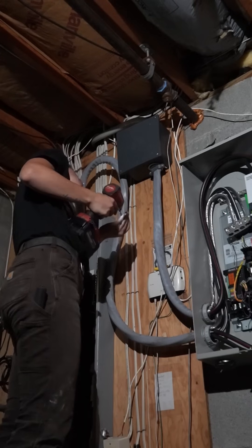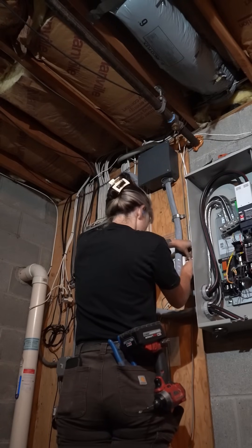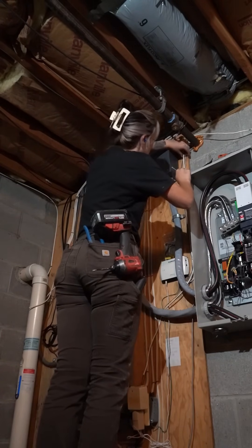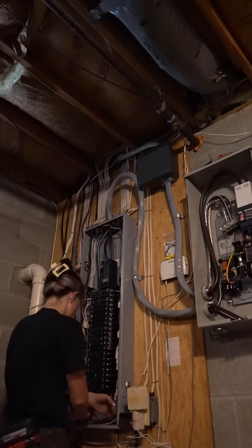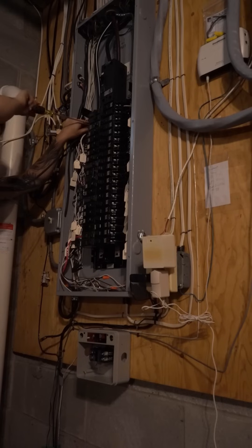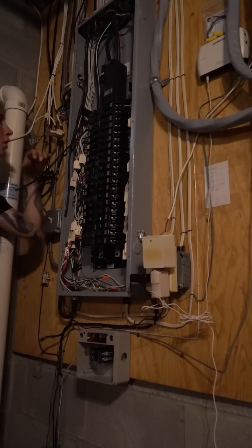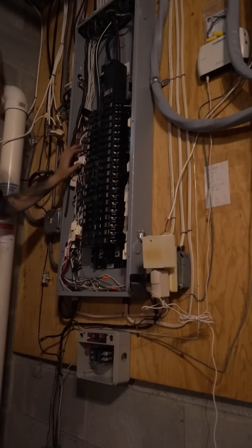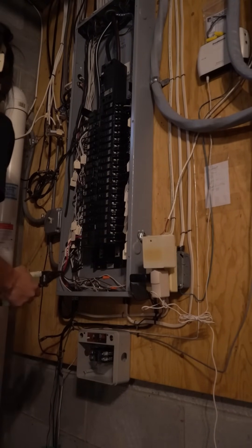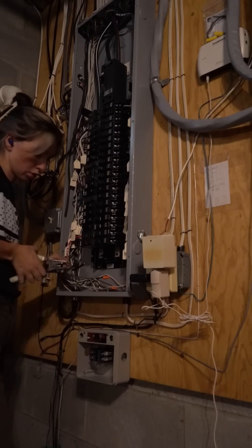I closed up the box and tightened all my connectors, then turned the power on almost immediately. I'm strapping the service and zip-tying the low-voltage wires I'd pulled off the wall to keep things neat and tidy. I also moved the neutral that was on the ground bar and removed the bonding plate, isolating neutrals and grounds. At the bottom you can see a small square box — a load shed module — which is installed with the generator. When running AC on the generator, you don't want it to overload at startup, so the load shed module lets the second-floor AC work when the power goes out.